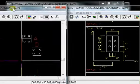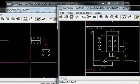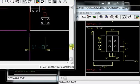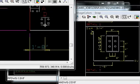You can see that pattern D is already in the correct orientation, but you're going to have to flip it around for each corner, or where it applies, obviously. You have 1'8" to the center of D, then 8 inches coming back on D, and then 4 inches to the first pattern. So it'd be 1'8" to the center, then 2 inches over to the center of the bolt, then 4 inches up to the center, and then 4 inches back to the next one.